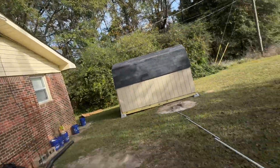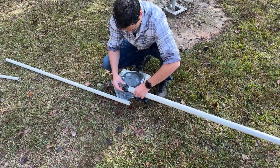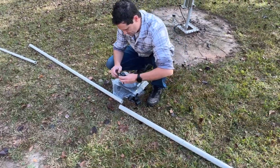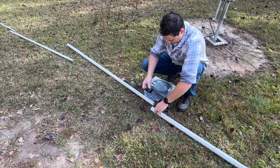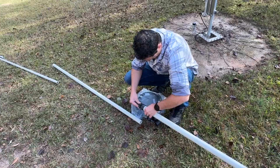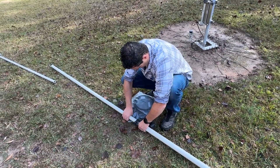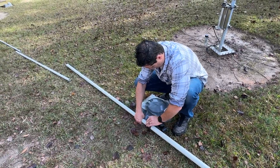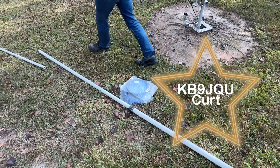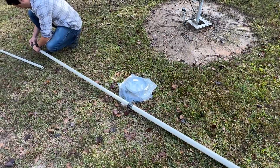I want to mention too — you can see down there the coax. There's a 50-foot piece and then a shorter 12-foot piece. That's LMR400. We're switching out what he has right now, which is RG-213, for LMR400. That's definitely an improvement for VHF and UHF. I want to thank Kurt KB9JQU for donating the coax for this project.